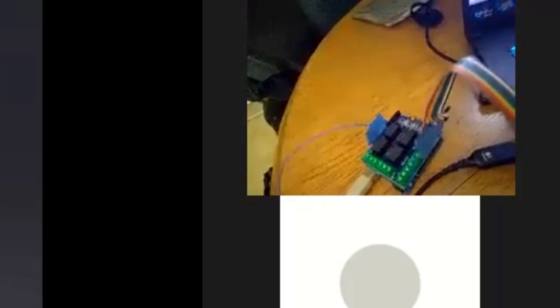Yep. Okay. I'm going to click the play button, and it's going to go through these colored sequences in each of the channels, and I think it'll play the sound. You can see the LEDs clicking. Sorry, you can hear the relays clicking maybe, and you can see the LEDs flashing in the sequence that is on the screen. So the sequence is in working order and the Arduino is connected and it has the firmware installed and it's playing back the sequence.